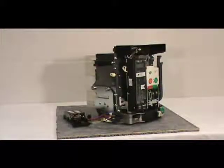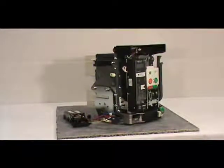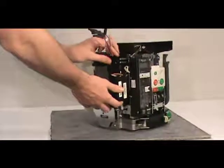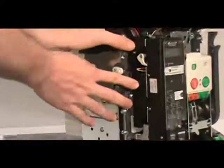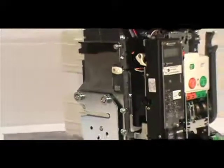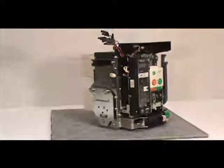After you've secured the UVR, shunt trip, and overcurrent trip switches, and routed the secondary leads, place the left accessory tray in its original position. The secondary leads should extend out from behind the trip unit once the left accessory tray is installed.